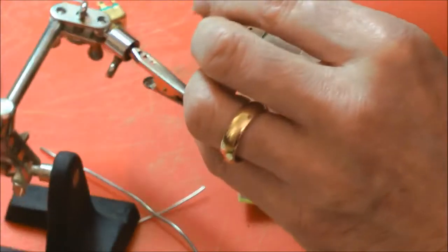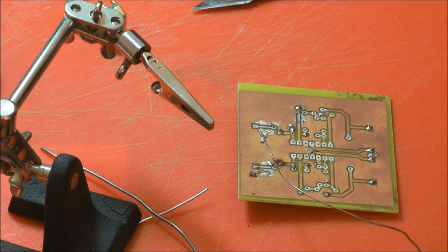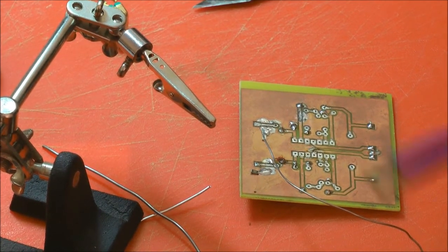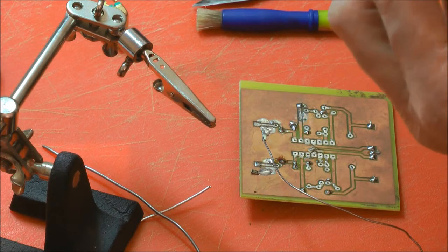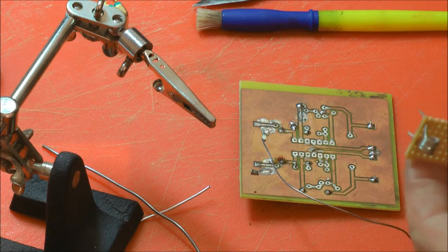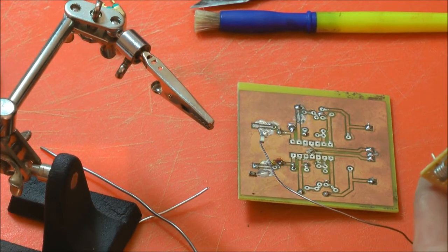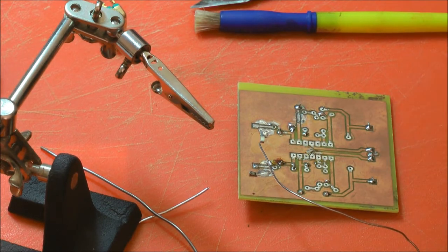That's gone round. Looks like it has. Now that's kind of as soldering goes, making a joint, that's perfectly okay. But what often happens, depending on your board, and that's okay, but you'd say cut them back. The danger there, depending on the actual components, especially with steel legs, is you can then get oxidisation forms and it actually goes down.